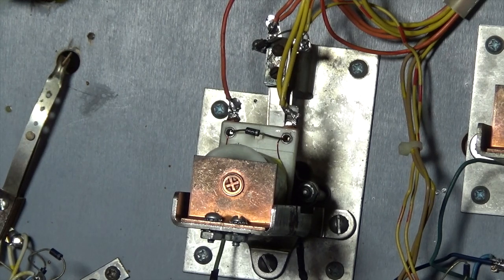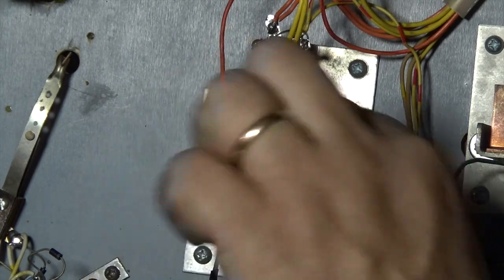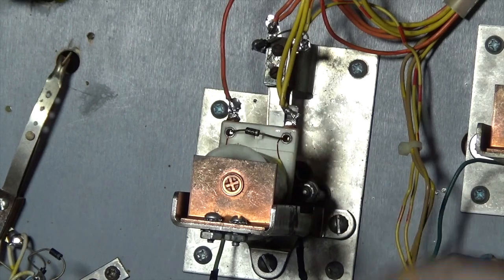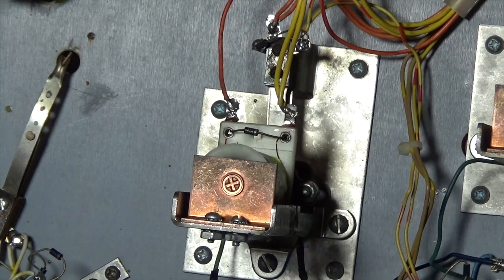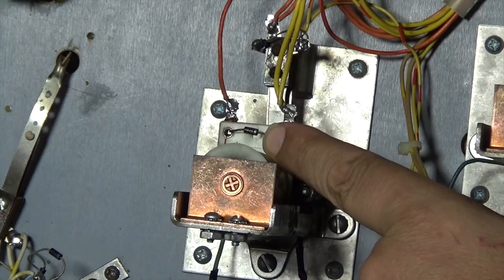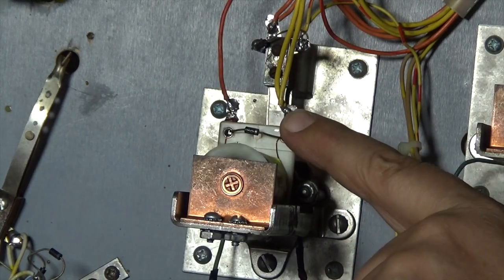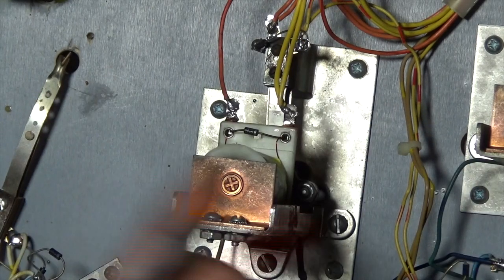Now there's a couple of ways to determine the negative lead. On this, which is an older Stern machine, which again I'm learning about as I go, you'll see that even the small, single solenoids for the pop bumpers and the slingshots have got diodes on them, okay? And one of the ways that you can determine which is the positive and the negative is the diode has a band on going to the positive side. So you know that this is the positive and this is the negative.